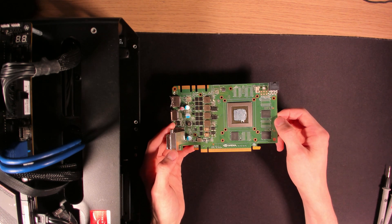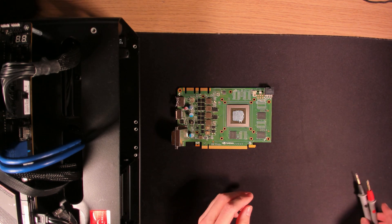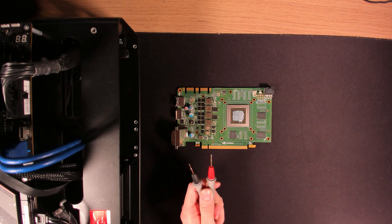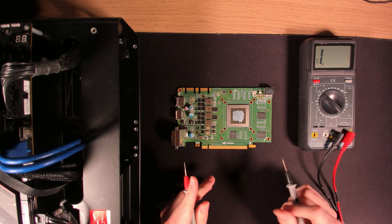This one's dead. I don't really know what's wrong with it — I haven't taken a closer look at it yet. That's what I wanted to do in this very video. The first thing you should do when you have a dead GPU is check for shorts on your power input rails.